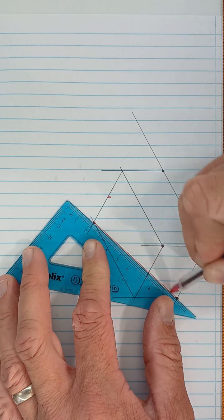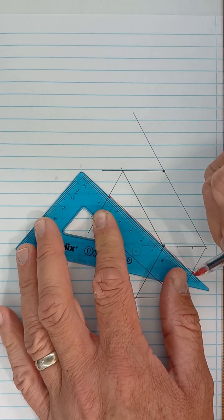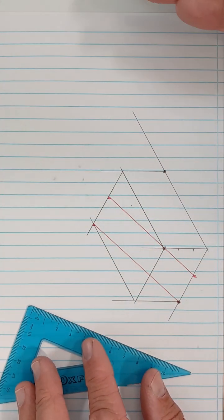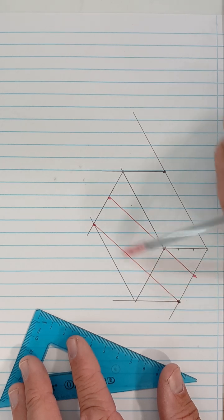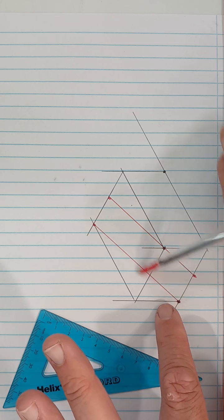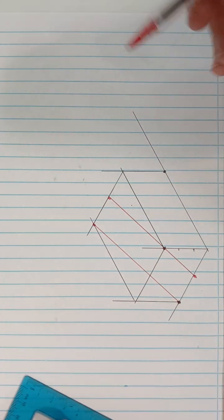Normally guys, a wheelchair ramp has to be at a very slight angle, because otherwise the wheelchairs will not be able to go up. This is obviously too high. I think it's normally 1 to 12. So if it's 1 centimeter, it will be 12 centimeters long. That's actually the correct slope normally that we use.